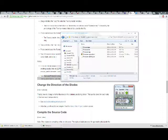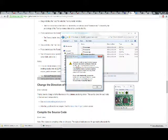That's the Teensy EEP. I'm gonna hit the reset button and wait for it to do its thing. Reboot. Okay, automatic mode has been disabled because the board returned to bootloader mode very quickly. This is a safety feature to prevent an endless loop of continuously reprogramming when the file is blank or contains code that quits or crashes in a way which jumps to the bootloader. If your code intentionally jumps to the bootloader expecting an automatic update, please add a 2-second delay to avoid this automatic mode safety feature.